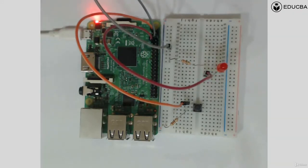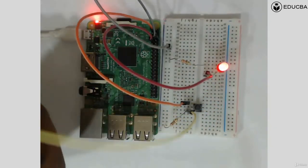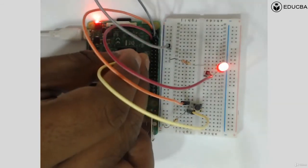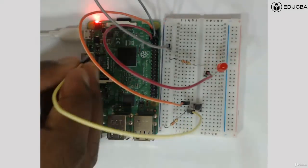So I can actually tap that particular line. So how do I tap it? Let's tap it by putting a wire into that particular line and then connecting that wire to, let's say, pin number 1, 2. You can connect to any one of the GPIO pins. So let's say we will use GPIO 18. GPIO 18 is pin number 12. Or we'll use pin number 11, board pin number 11. That is GPIO 17, pin number 11.